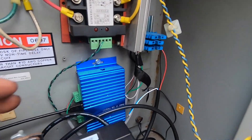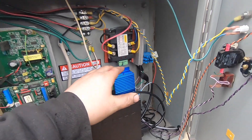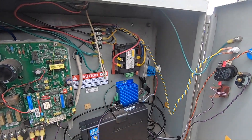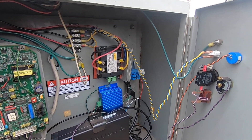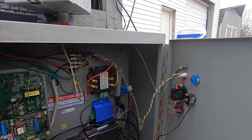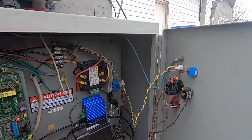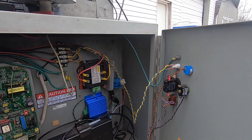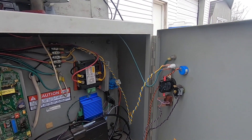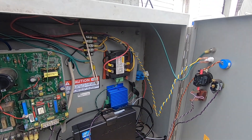Probably the most important part here is the YourDyno box — yourdyno.com. These are really good units. You can think of it as a standalone ECU for your dyno. I could run this on any dyno — a Mainline, a Dynacom, whoever — as long as I've got a roller speed signal and I know the inertia of the dyno. This thing does everything you need really nicely.